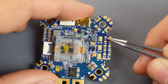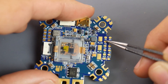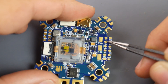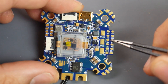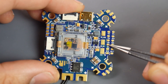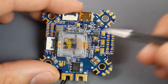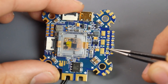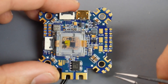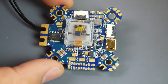They provide five UARTs. The S.Port pad is this one right here, and here we have RX1. On the bottom we have TX3, or SCL for I2C protocol. On the right side we have SDA for I2C — you could also use this as RX3 and TX3. Going down, the third one is RX6 and TX6, so that's UART6. Here is a 5V USB pad, so if you want something to take 5V while USB is powered on, this is where you'd put it. There's also an S.Bus pad, a buzzer positive and negative, a 5V pad, and the LED strip signal control.